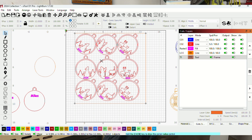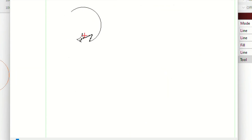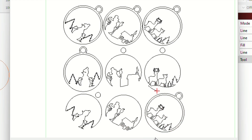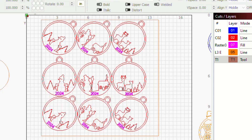To do that I do have to tilt some of these — you can see — because otherwise they'd be too tall if I did them all vertical. I tilt a few about 40 degrees and can fit them all on there. That's nine ornaments — really efficient use of materials. Let's look at the preview. I've got my cut going on, and you can see it's cutting the inside shapes first, which is good. Then it starts cutting the outside shapes, and finally we do the engraving. That total engrave time is about 41 minutes.